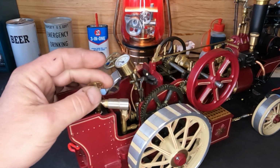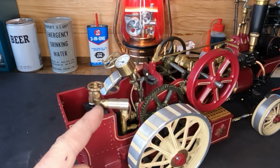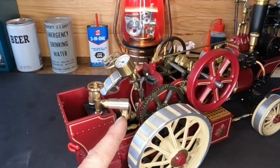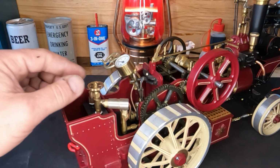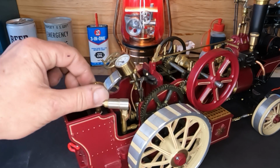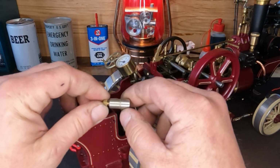So yeah, we've got no flow at all coming out of the end of our orifice. We know we've got gas to this point, so we've either got something happening in this block or in our orifice. Let me get this orifice out and we'll check to make sure that our block's good. Give me a second, I'll bring you guys right back. We've got this loosened up. We'll take it out together.